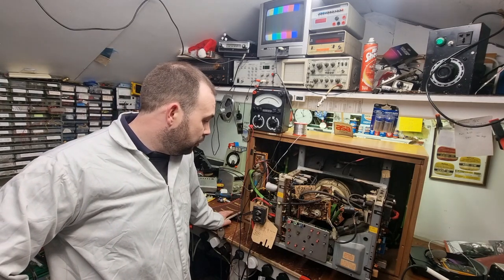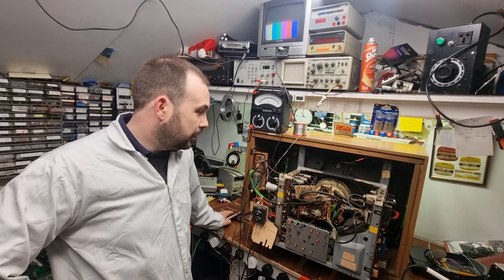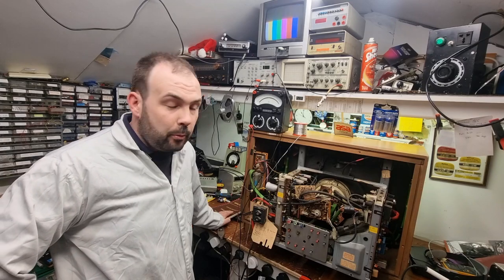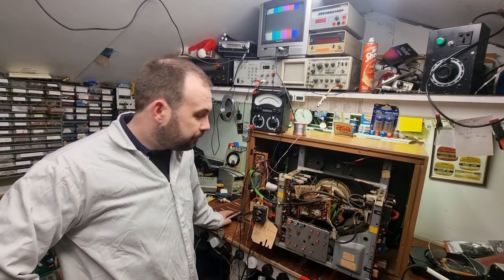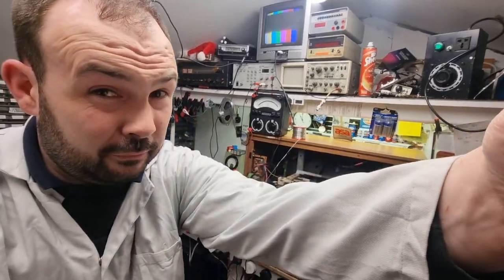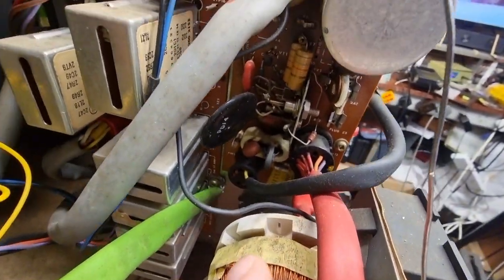So I thought we'd have another more in-depth look at this television today, set it up and that. The focus isn't quite good, the convergence, all those bits and pieces. But we have run into a little issue, and that is the thermistor for the HT supply, which is a stock fault, has of course gone open circuit, and it was actually arcing